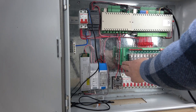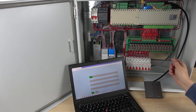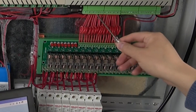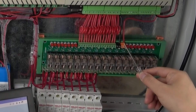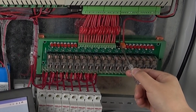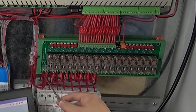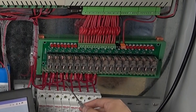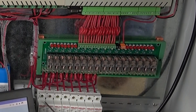After we install, I will show you. You can see we have replaced the E16 channel board and it works with this H32BS. This is the output — channel one, two, three, four, and up to 16-channel output — going to this part. This is DC 12V connected together with the DC 12V supply, and the black is ground for the power supply ground. This is the output — the output is COM and NO, where NO means normal open. We connect the COM wire together with the live line and the output is connected to the load.